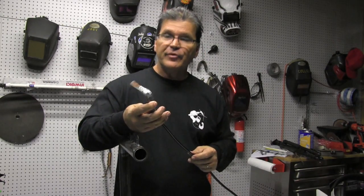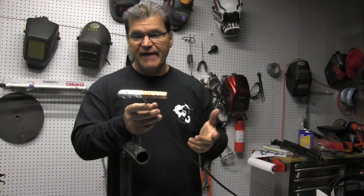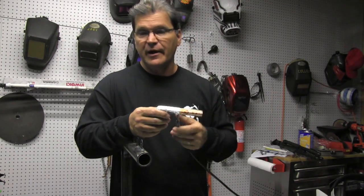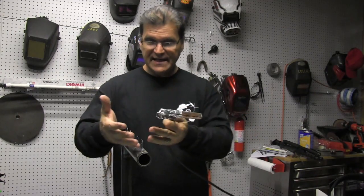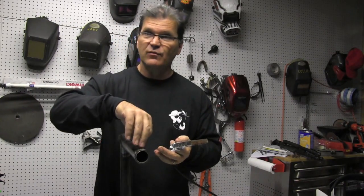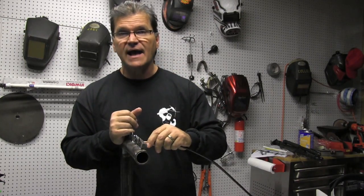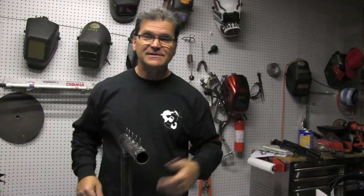I also used this little backup gas apparatus. At a previous career we used to call these backup boxes — just something we would fabricate on the spot to a certain shape or size wherever we needed it. It was an aircraft parts repair job so we had to get shielding gas to the back side of welds and tabs like this. They're going to heat up and scale on the back side when you weld one side — first side welds great, the other side welds like sparklers. But if you use something like this to get shielding gas on the back side, that front side welds good and then the second side welds good too because it's not oxidized.